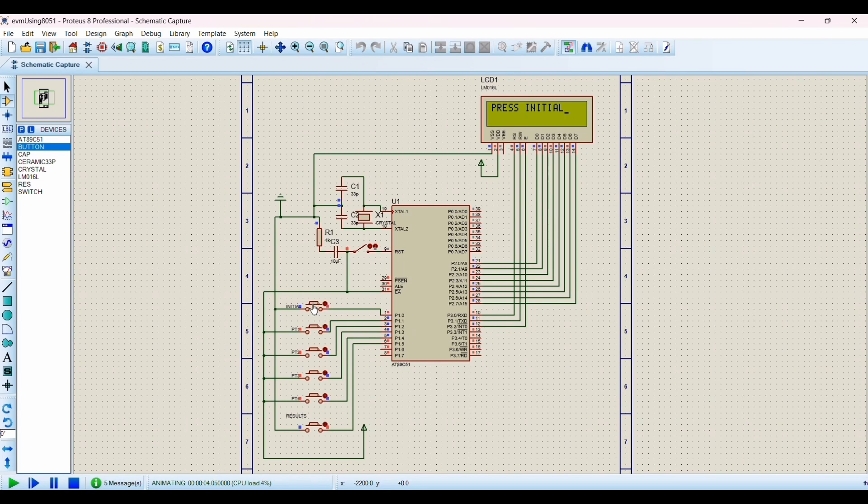To make the polling switches available for voting, the initial switch must be pressed first. When the client votes in favor of a candidate by pressing one of the switches, the value of the relating variable is incremented by one. A thank-you message is then shown on the LCD to acknowledge the vote. The initial switch must be pressed for each new voter and the process repeats.